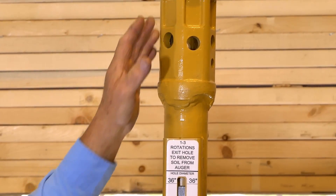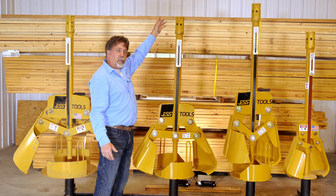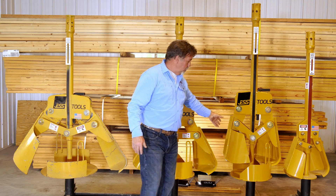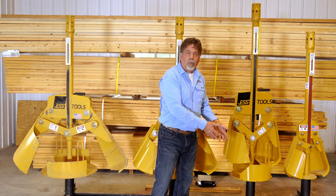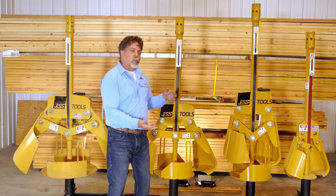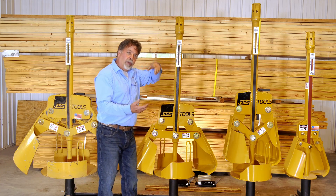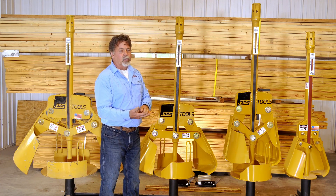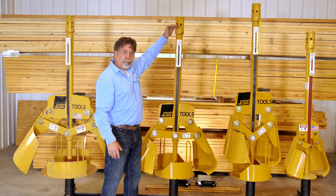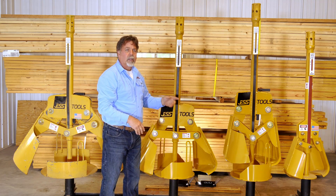The way they're designed: this one is completely extended out. When you pick this up with a skid steer, all this folds back into the closed position — it folds back in so it'll go down in the hole. Once the base hits the bottom of the hole and you start pushing on it — say it's really muddy so you don't have to push very hard — you push down a little bit and start cutting. Usually in two or three revolutions, it's got as much in it as it needs. Then you stop turning, pick the auger back up, it collapses the things back in, pulls the dirt inside, take it out, shake it loose, it dumps, go back in, cut some more.